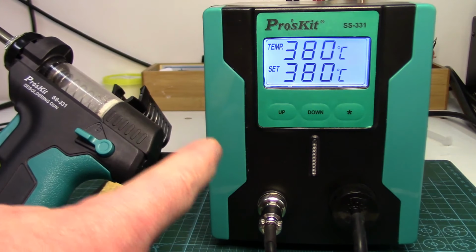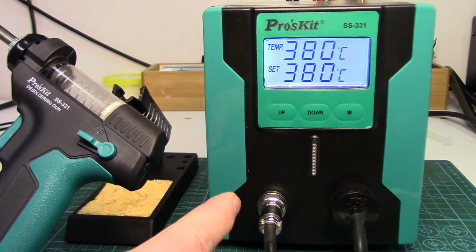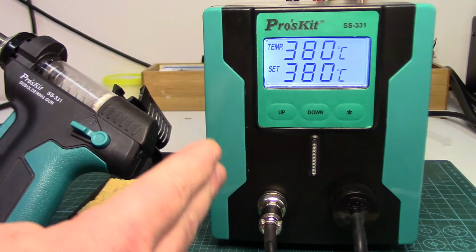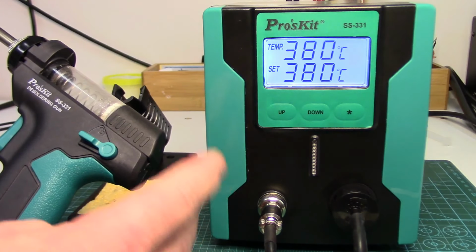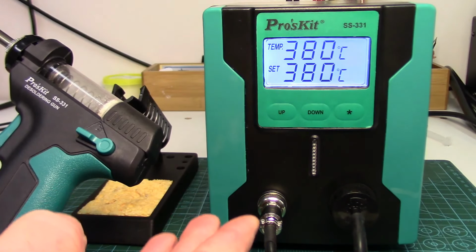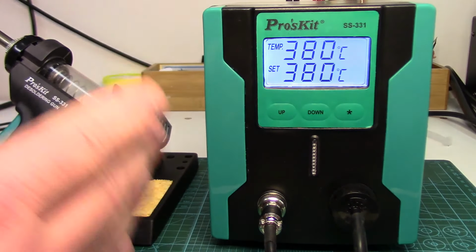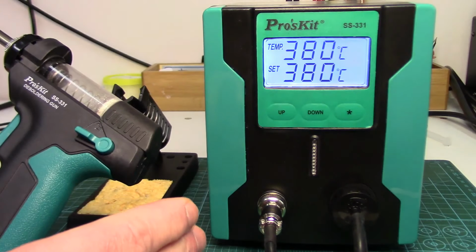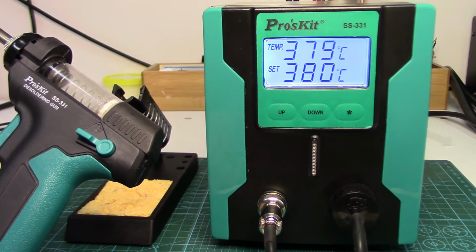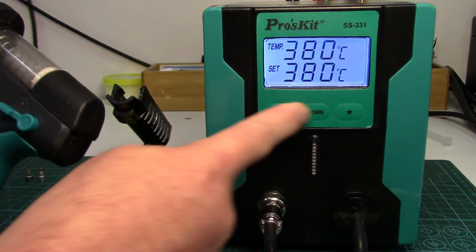I should mention that switch mode power supply, you cannot switch it. That's what I thought at first too. Oh, you could go into the switch mode power supply, there'd be a little switch, because a lot of switch mode power supplies are universal voltages. Not so with this one, it's specific. So if you get a 220 volt version and you're on 110, you're going to have to get a step-up transformer for it. The other thing is I hate the membranes.